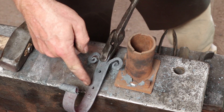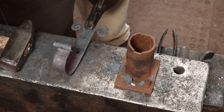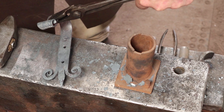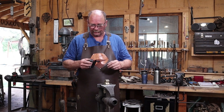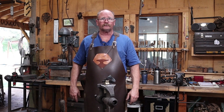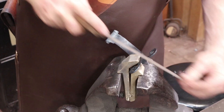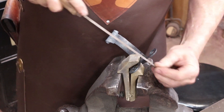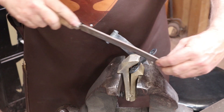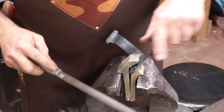Make sure that the end of your hook doesn't block your access to your screw hole. Next thing I'm going to do is a little filing up here to clean up that top center element. I've let this cool and turned off that noisy gas forge so you can hear me a little bit better. We're going to go ahead and do a little bit of filing. It's a good place to use a filing vise — it holds this at a comfortable angle and you can see what you're doing. Mostly I just want to take off the lumps and the rough spots. We're also going to bevel this a little bit, at least this center element.